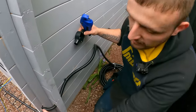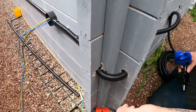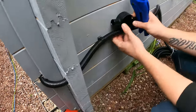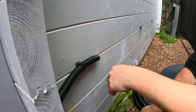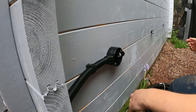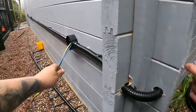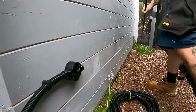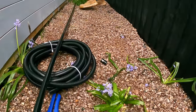So have a look - that's what I meant by copexing just to get around that bend. Last time we did it stupidly right in the centre and it was dead tight. I'm just going to stick a box on there to basically transition from the copex over to the conduit, to get us over to that other socket. It also helps pulling cables around this bend. We could use a coupler but it's better having a box.